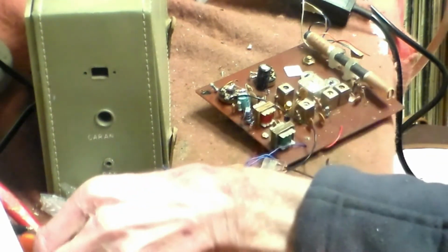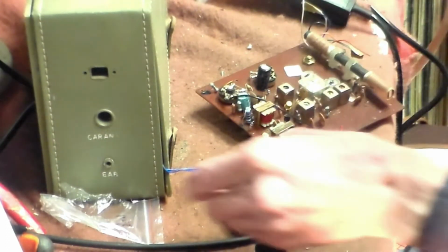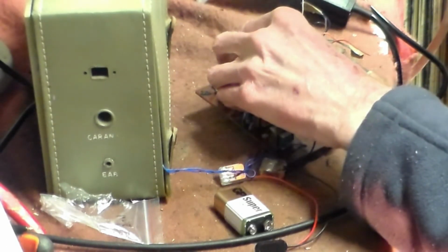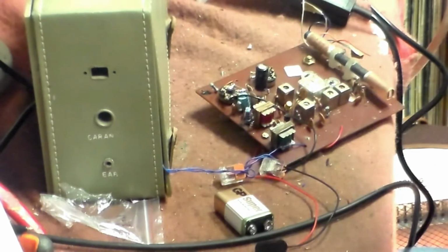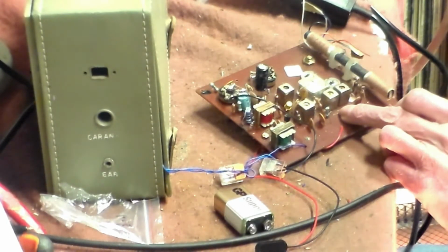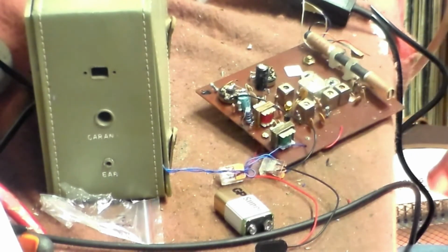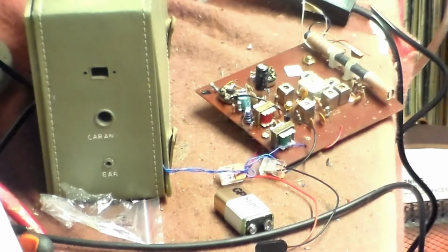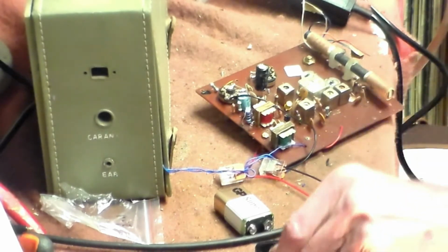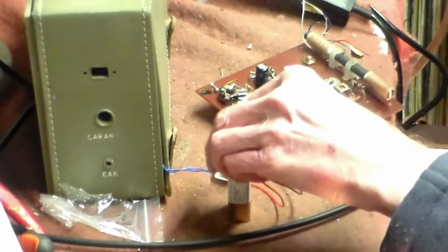So these capacitors, I don't know what type these are. AEI. I don't know what AEI means, but these are the ones that are in it. And in this particular case, they are, shall we say, not good capacitors. Also, the capacitor on the other side of it, underneath the tuning dial. So that's on for now. I might take it off, but put the cap between there and there. It does work if everything else does. This thing is a disaster.